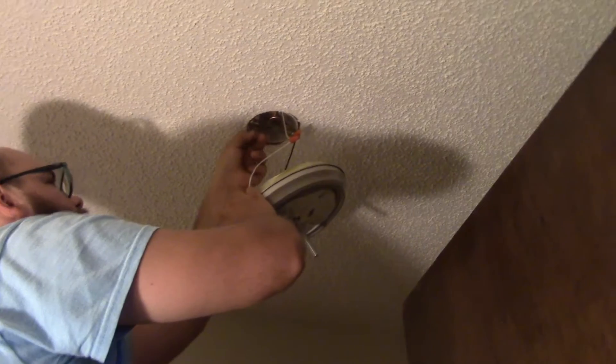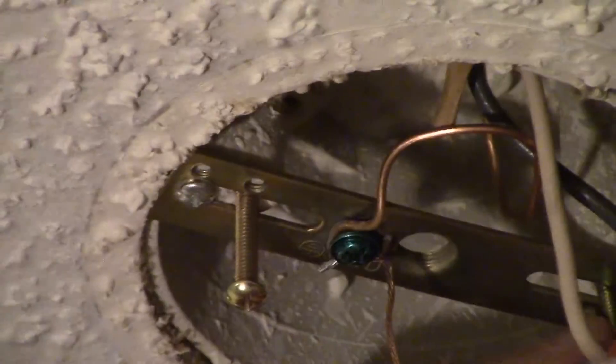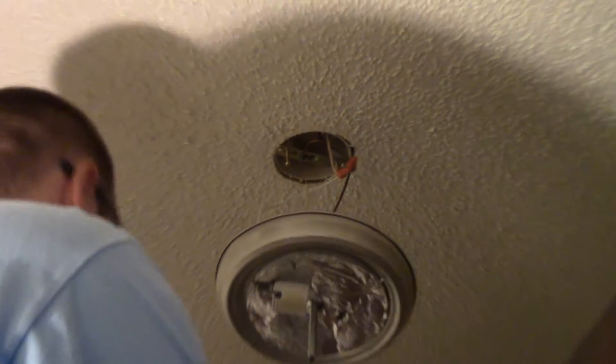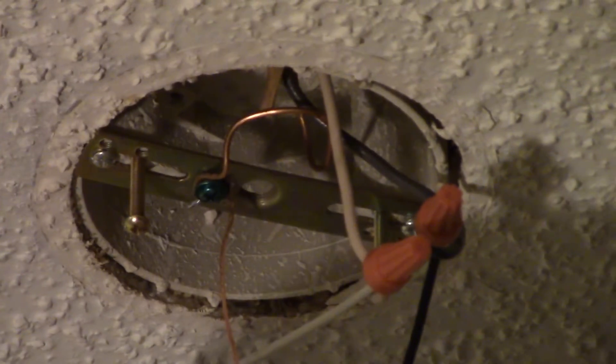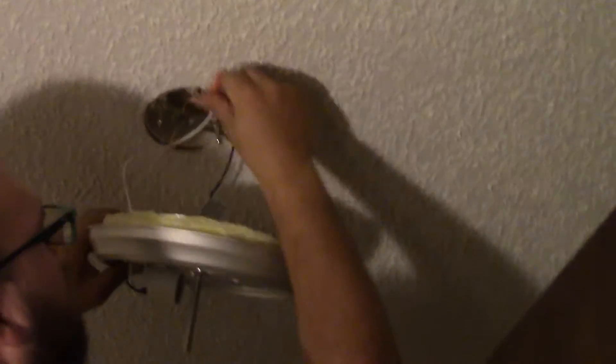With this particular style it's got these two little machine screws and they're going to go on the inside holes of the old fixture and through the slots here. This may be a different mount from the light fixture that you got - this is just this particular style, so bear with me, yours may be different. Stuff your old wires in if you can.